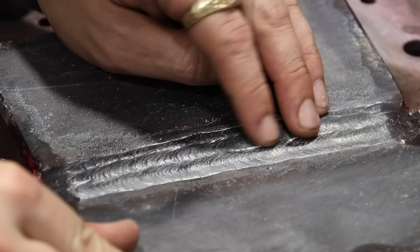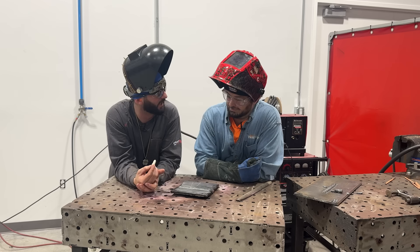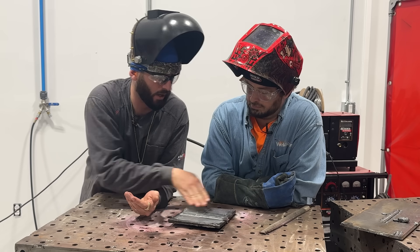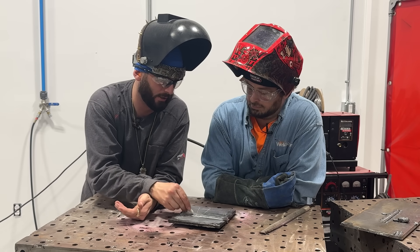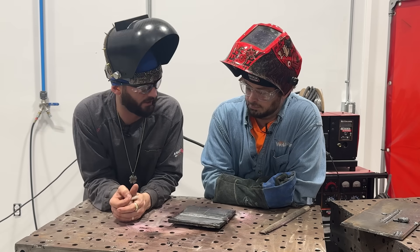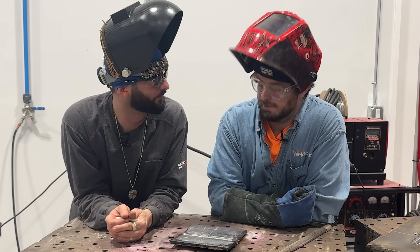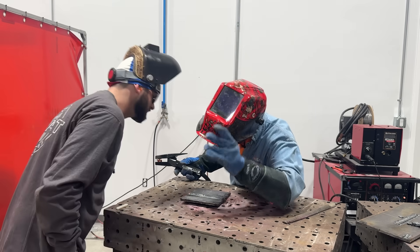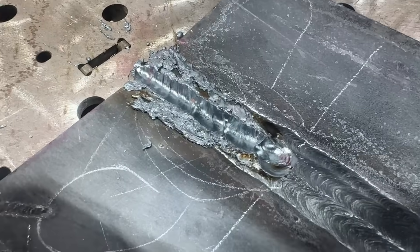All right Bo, I've got a groove weld here for you. The goal when you're doing a gouge like this is to maintain that original groove angle from beforehand. Typically you'd start in the middle and then widen things out. Remember, if you've got a repair right in there, your whole area of repair is probably going to be three to four or five times as big, depending on how big the issue is. Get to digging. You can tell what clean metal looks like right — yeah, keep digging.